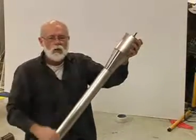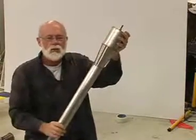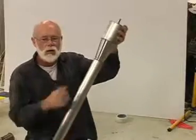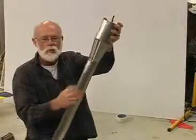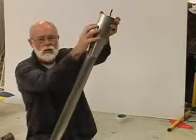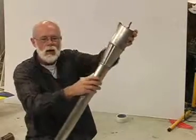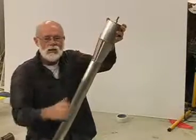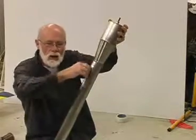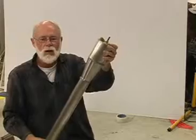As the hot gases rush down the tailpipe driven by pressure in the combustion chamber, eventually the pressure in the chamber runs out — all the fuel and air has been burned and the gases have expanded. Now the pressure inside equals the pressure outside, but the gases in the tailpipe still have inertia and are flowing very quickly. This acts like a giant syringe — those gases act like the plunger, pulling on the combustion chamber, creating a partial vacuum — a reduction in pressure. The chamber now has less pressure than outside, and because the gases have mass and are traveling so fast, they continue outward, causing the pressure inside to keep falling.